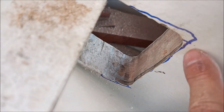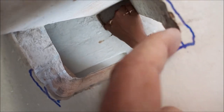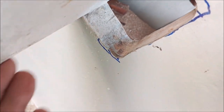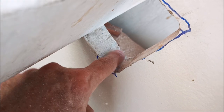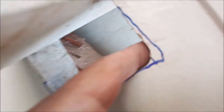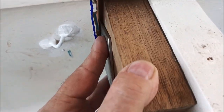I've got these ones done. This is kind of my blue line — I was going to come up and dremel some of this out but I already got quite a bit of epoxy up here. I just need to fill in that little place where I did a little dremel right there. The bottom has to be level with the bottom of this, so these lines need to be the same. I'll build this up a little bit on this side and fill this in. I've got at least an eighth to three-sixteenths of an inch of epoxy I can put on there. I use this mock-up wood to gauge how much room I have up and down.